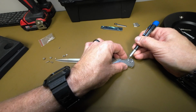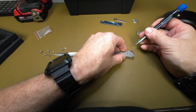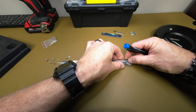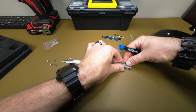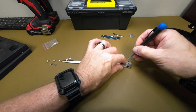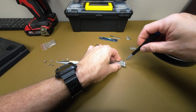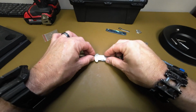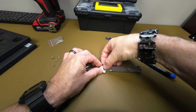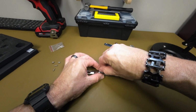And again, remember, we're not really torquing these down tight. Even when you end up putting your Vibratite or Loctite on later, you don't want to crank these down. The smaller the screw, the easier it is to strip. So these threads are teeny tiny. They're very precision, so you don't want to torque down on them. I say that a lot in these videos, but that's because you can't believe the number of people that call and they've literally destroyed the screw because they grab it with their whole hand and a big old screwdriver handle with a little bitty tip on the end, and they crank it thinking they really got to tighten it down. But again, it does not take much at all.